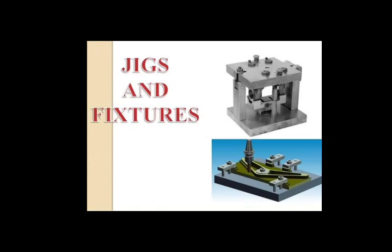Carbon steel contains 0.85 to 1.18% carbon, and it can be oil hardened to Rc63. In case of heavy wear situations, carbon steels can be used. Spring steel or clock steel contains 1% carbon and 0.5% manganese, and it can be tempered to Rc47. Oil hardening non-shrinking tool steel, that is OHNS, contains 0.9 to 1.1% carbon, 0.5 to 2% tungsten, and can be hardened to Rc62. And the last material that we have to discuss is phosphor bronze.